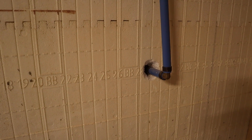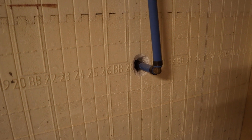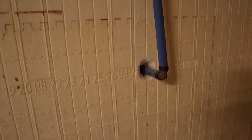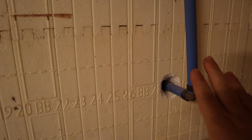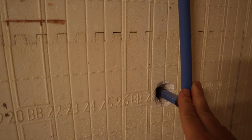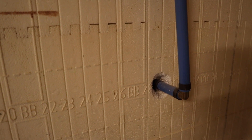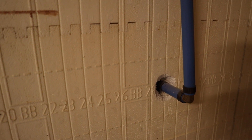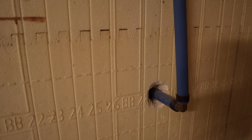Here's another one of my water lines — it's poked through. I drilled this one as well. It is technically above grade and goes to a water spigot outside. But regardless, I don't think I'd recommend placing the water pipe through the block prior to pouring. I kind of like the idea of being able to easily pull this back out if something happens or I need to replace something. The pipe penetrations do not have to be tough — I suggest just keeping everything very, very simple. Use simple tools.